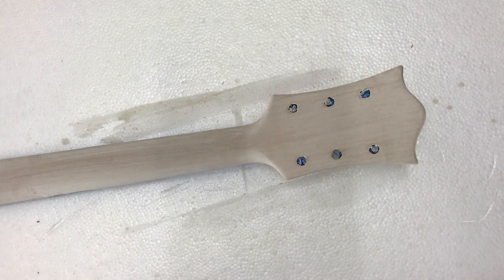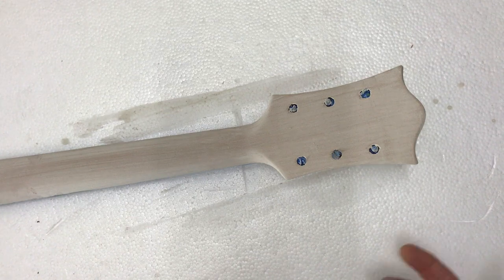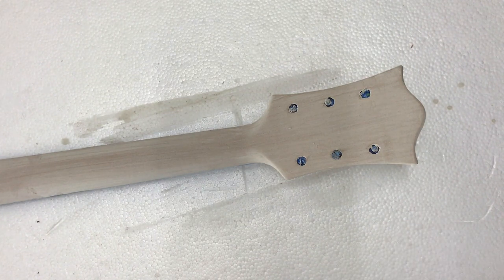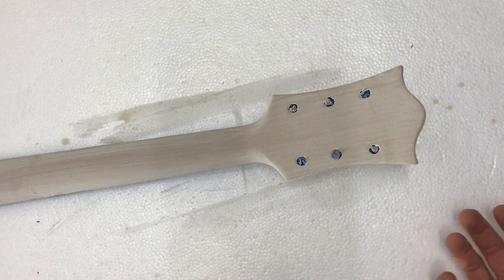Now when you're sanding grain fill, we really need to just sand level to the surface of the wood. With sanding, I used to sand a lot to a lot finer grit at this stage, but these days I generally start with a heavier grit. So start with a 120 grit, work my way up to 180 and then on to 220.